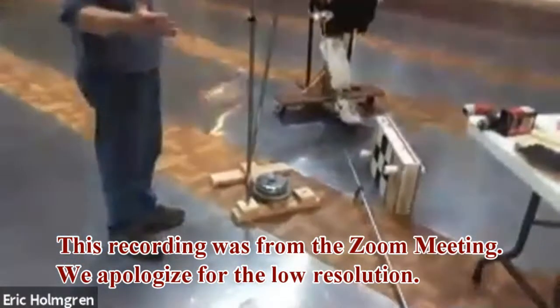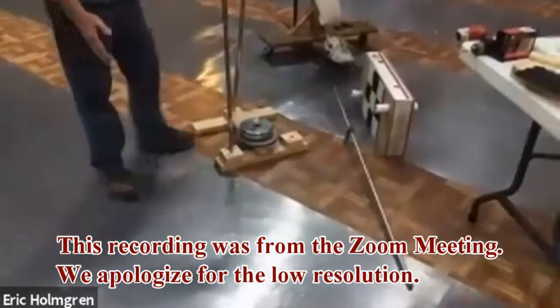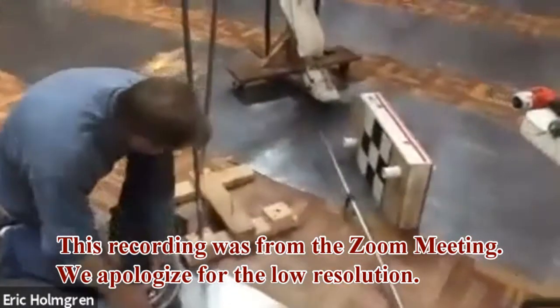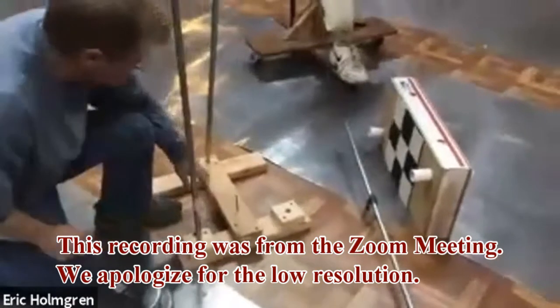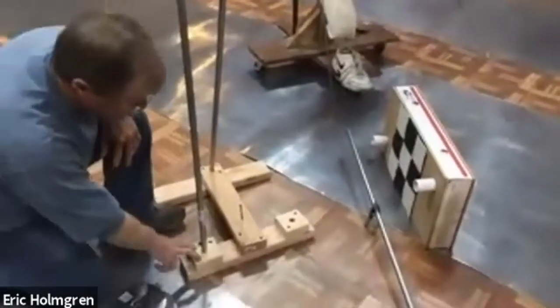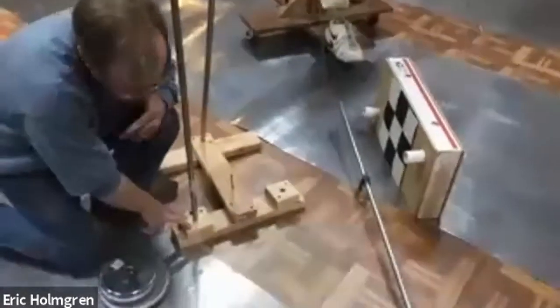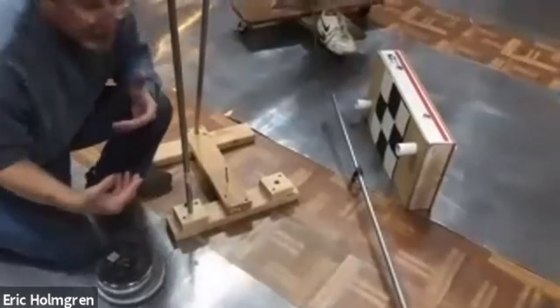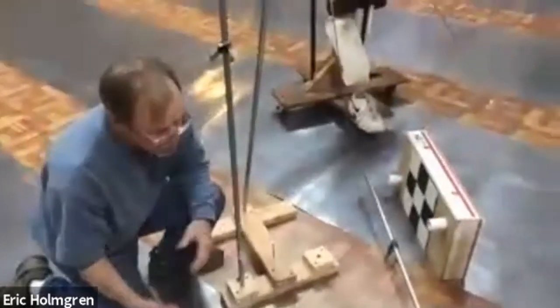The standard sloth is just two by fours. I cut these to be 18 inches wide — this one's 18 inches long, this one's 18 inches long. These are cut square because it's symmetric, and that's three and a half inches on the side, because a two by four oddly enough is not really four inches wide — it's only three and a half inches wide.